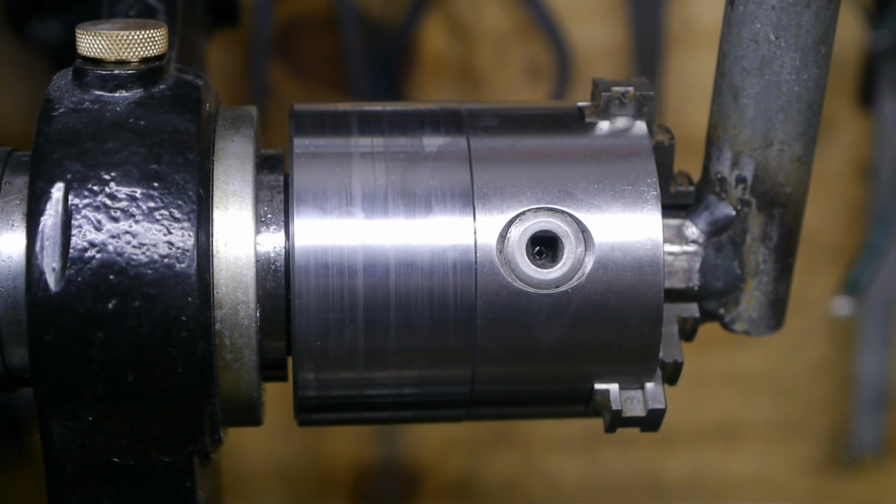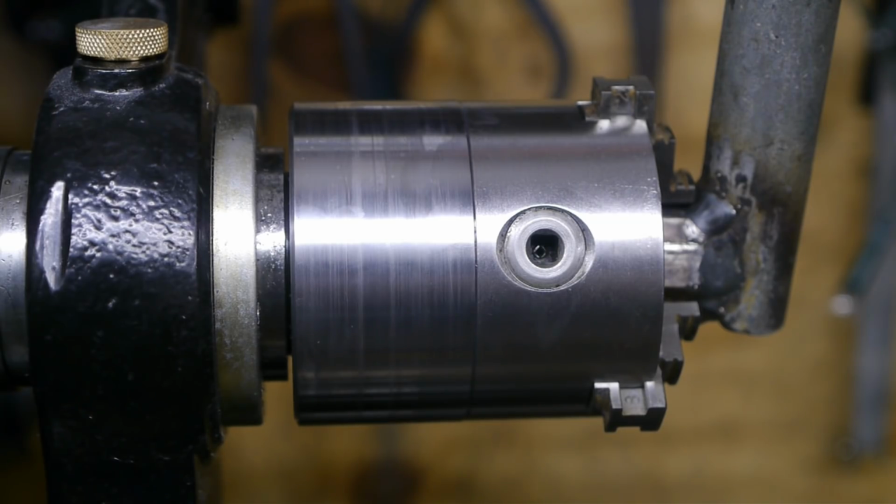So the best course of action would be to just turn down the backing plate and carefully remove the last bits. Maybe then I can save the register on the spindle. Now this is a rather disappointing end of my Christmas special. Just my luck. Well, Merry effing Christmas.